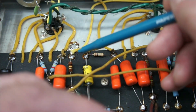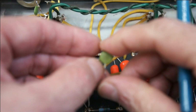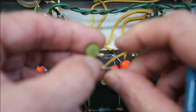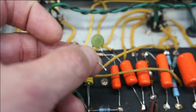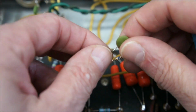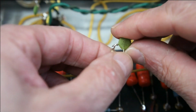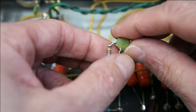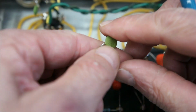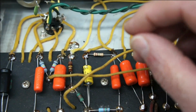That's also where I stole the 100K negative feedback idea, because there are amps like the Hotel Hog and other modified Fenders, which Alexander was doing in the last, when he couldn't build amps top to bottom, he was modifying Fenders for people towards the end, and he was using tricks like this, or techniques like this, to improve the voice of the Fender amp. So I'm a big fan of this. I've got it in a few different amps, and it really makes the amp sing. Let's give it a listen.